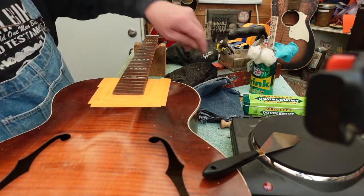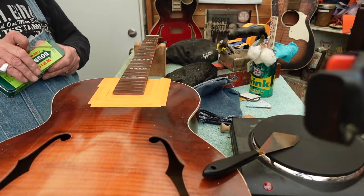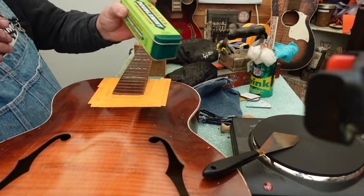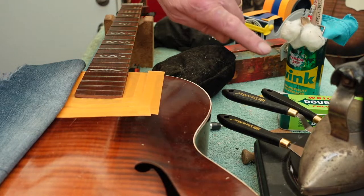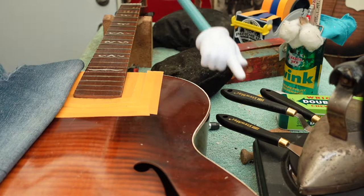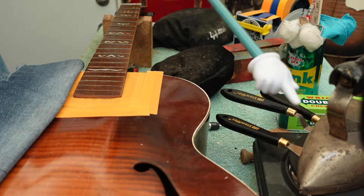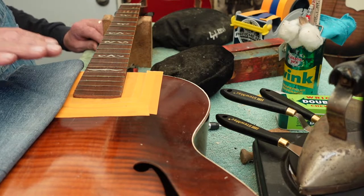Not damaged. We're going to put that in our box there. You can see the iron is back on the hot plate and the palette knives are underneath the iron and on the hot plate, so they're ready to go when I start wanting to work this loose. Remember it's not going to come loose all the way up here because everything is still attached — we're just getting this fret out of the way.